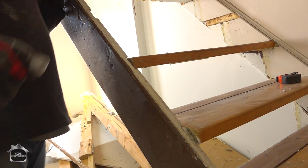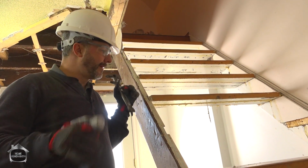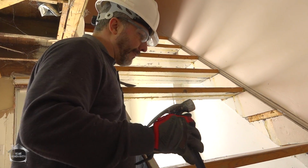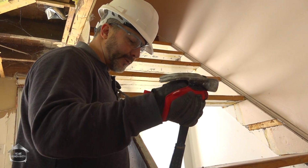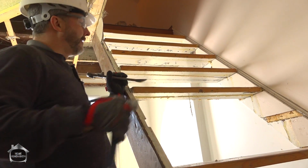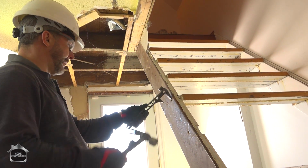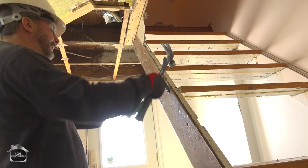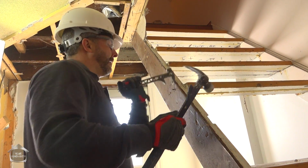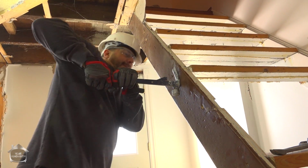I'm going to be carpeting the stairs because it's an old house and I like things quiet and the feeling of warm. Carpet just works really well for me. I can also cover up the side of the stringer with it. And I'll just do a waterfall carpeting technique. No nosings, nice and simple. Just make my life easy. But for now, I just gotta find all of these nails, put your weight into them.